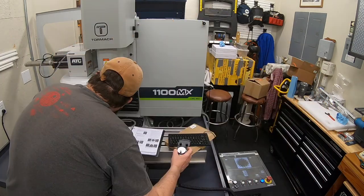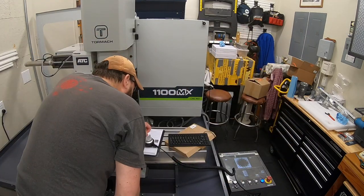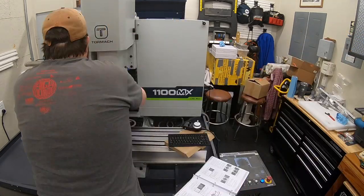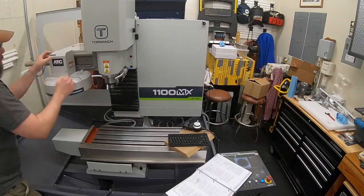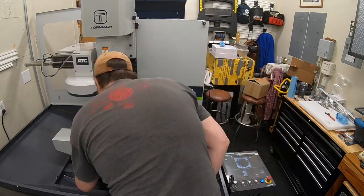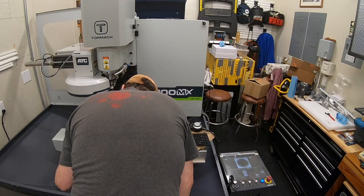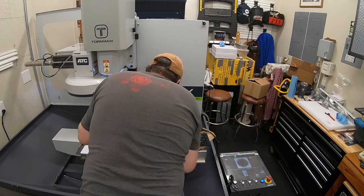We're getting there. You can see on the screen that the automatic tool changer shows up. Get that tab. You tell the machine that you've plugged it in and that you've hooked it up. And just, again, walking through all the instructions on how to go through that setup process. Tells you where all your different adjustments are to change lengths. You can lengthen the air cylinder a little bit. You know, what you can adjust, how you can turn the carriage when you need to. And just get everything lined up as best you possibly can. Zero the machine so it knows exactly where it wants to be on that Z height for tool changes. And the book walks you step by step through every single one of those adjustments. And again, really a nice interface for pushing all the buttons and making all those changes.